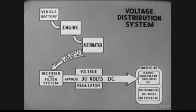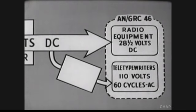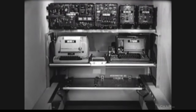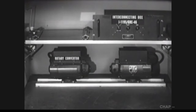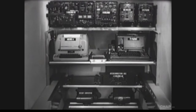It also has two other purposes to serve. First, it must be converted to the 110 volts of 60-cycle alternating current required by the teletypewriters. To accomplish this, we need one more piece of equipment — a motor generator, commonly called a rotary converter. And finally, after a voltage drop, it is fed back to the vehicle's battery for recharging. We would like to point out here that another component is provided: the interconnecting box J1195. Used in online crypto operation, it is mounted on the shelf just above the floor. Two converters are provided, one in use and one spare, mounted on the floor. We now have assembled the important functional components of the AN/GRC-46 and provided some of the required power supplies for each unit.